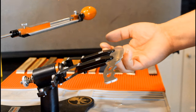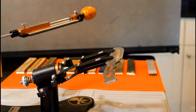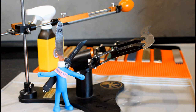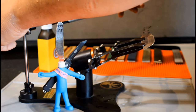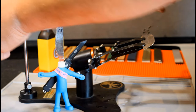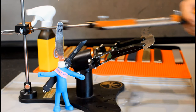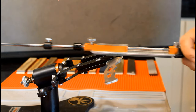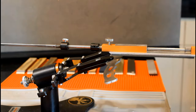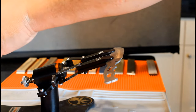And again, if you find the burr is not complete from one end of the knife to the other end, you need to do more complete cutting strokes. You will be tempted to rub the stone back and forth like a file over the problem spots. Don't do it. If you do, your knife will end up with dull spots, and you can forget about slicing paper with that shoddy edge you just made. Continue with complete cutting strokes only until the burr is from tip to edge, no matter how many cutting strokes it takes. Only the very first stone can be used like a file.